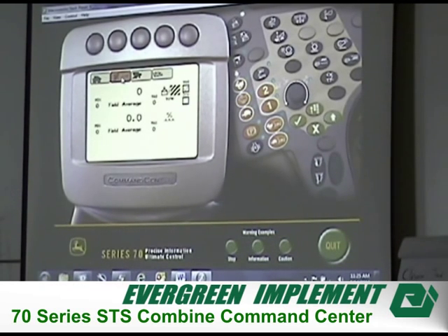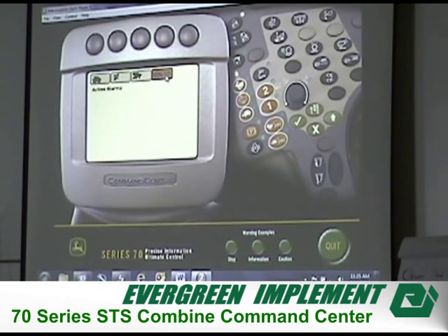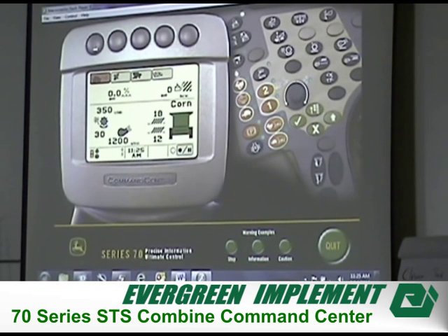The simulator is fairly accurate. If we go over to our diagnostic button, on the simulator we only have page one of two, but on the actual machine you're going to have page one of four — four different pages with a lot of in-field diagnostics. If you're on your main run page and you want to navigate, you can't just click on the screen. You have to come over to your scroll dial and scroll through to move the cursor around.